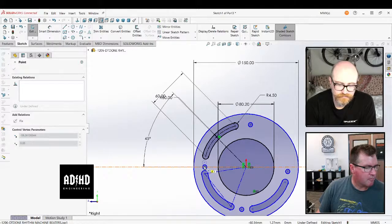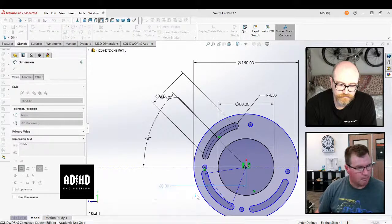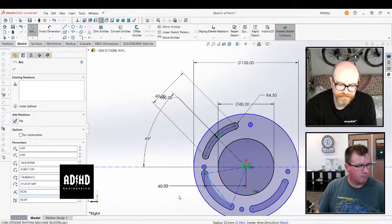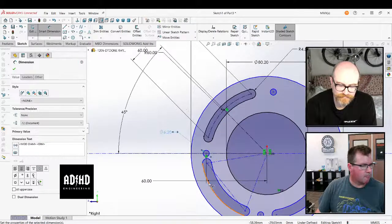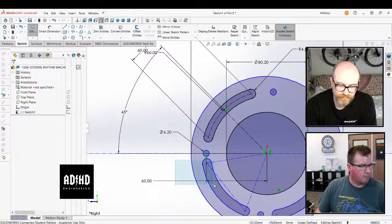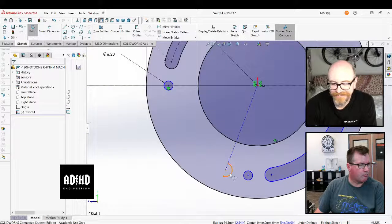Yeah, but I would just draw one dotted center line, a circle from your center point to the same width as your shaft, as your slots. Coincident those circles to those slots on the cross points, and just drag your circle so it's coincident and vertical. So this might have been a good reason not to delete the original body before you were done.